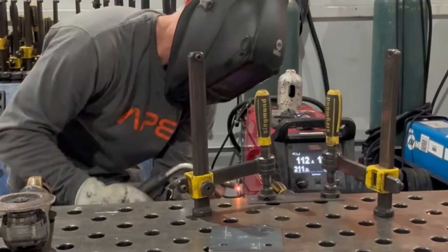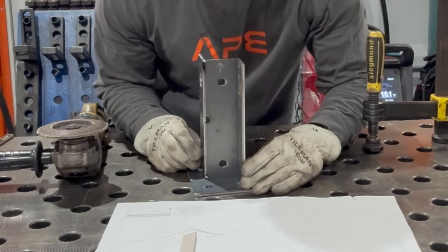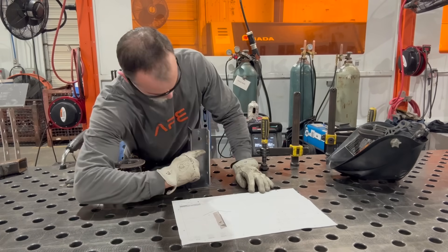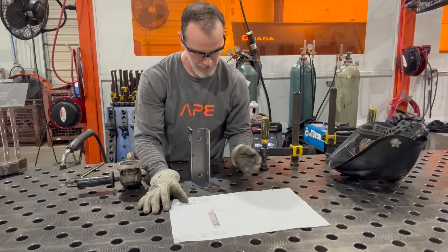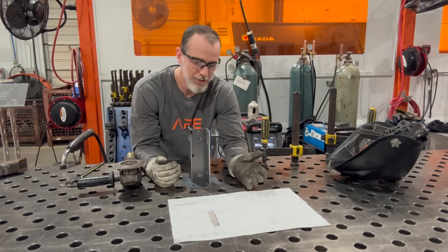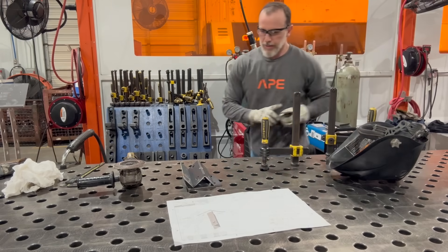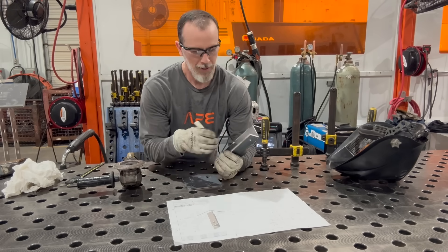I've got it tacked up and I'm putting it back against my layout lines, validating everything. Arrows up, marks lined up, parts correctly oriented - I do one last look at the plan view. Now, I could weld this to the plate, but this joint has to be ground flush all the way through - that'll be really hard to do with everything teed off. So I'm going to make this weld and grind it as a sub-assembly first, then weld the rest. I'll also mark the full-length weld line so I don't miss it.